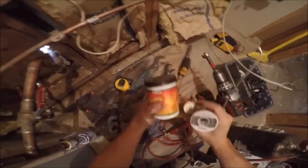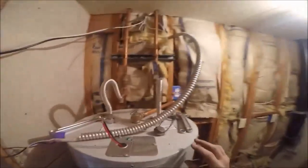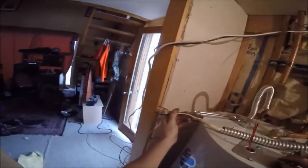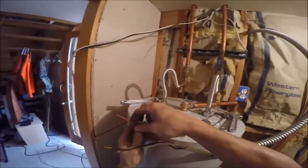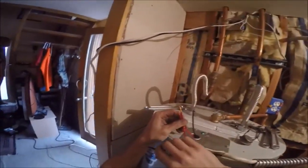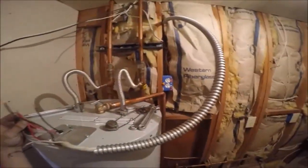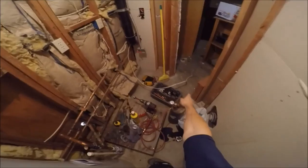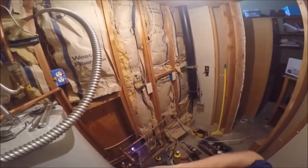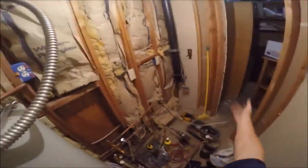I got an electrician on the way. It's pressurized. Hold on, let me set this down. I'm gonna connect the ground in this just with wire nuts. Boom, boom, boom, boom. We got two 20s here, and we don't know which one was which. The existing water heater they removed before I got here was off of this line. It's a 220. And got a sparky on the way. I don't know if that was a furnace run or who knows. This place is such a disaster.